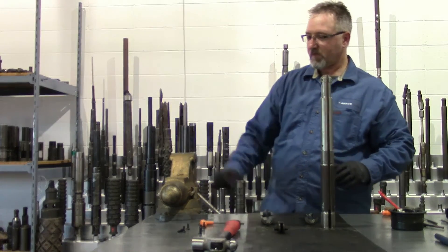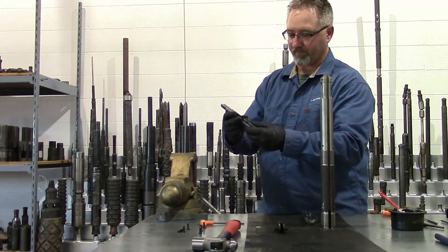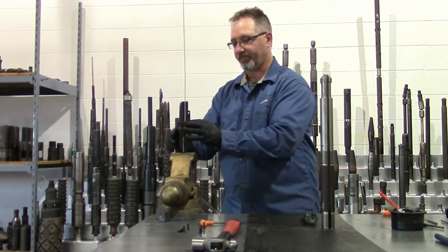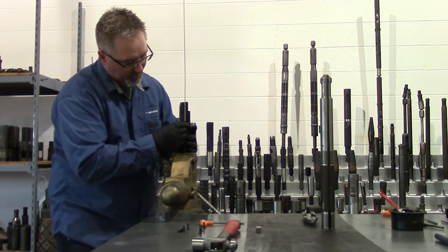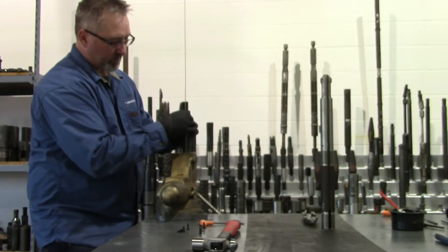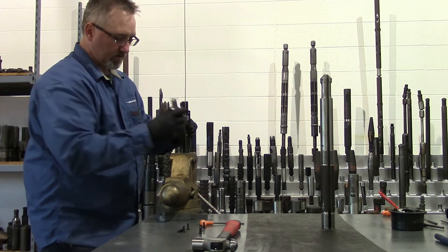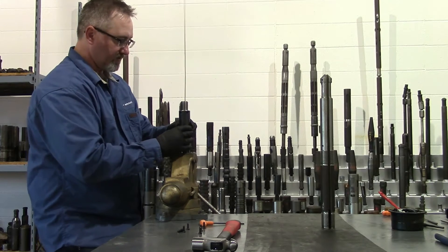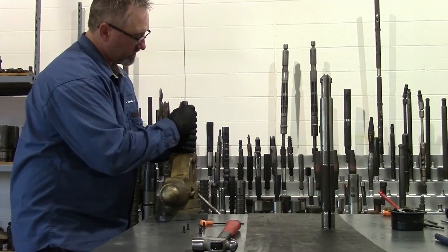We'll use this piece of shear stock as a simulated slickline and the top of the vise as a simulated BOP. Now that it's pinned in place so it can't slide up and down, we'll install that onto the line and hold it there. Then we take our cam and the slot has to slide over the line, then come down and align with the hole in the body. You'll hold that in place, take your cutter block and install it into the cutter block slot. It sits in there, then take your other half of your body, align it all, and install it onto the cam cutter itself.